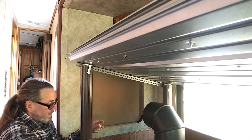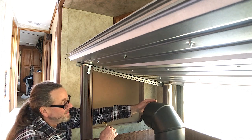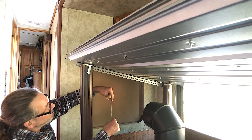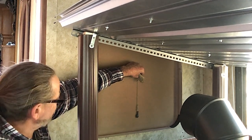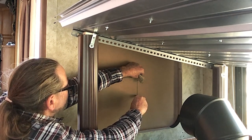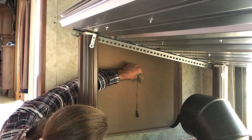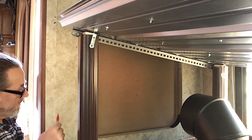There's some real redneck engineering going into this. I'm confident this dot is set — it's centered to the top but not centered to the circumference or diameter. So I've marked three and a half inches on my redneck plumb bob. If I hold this up to the top, it's level because of gravity, and I go to my mark three and a half inches down — that should be the center of my pipe. I'll double check. That looks about right.